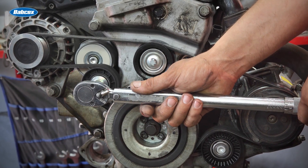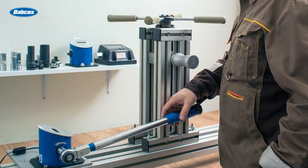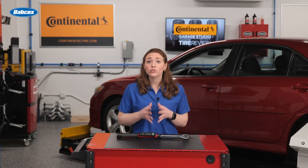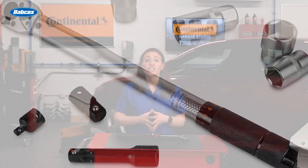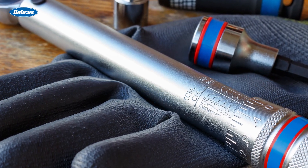So, how do you determine if your torque wrench is accurate? Some tool trucks have a torque wrench tester that can help spot a torque wrench that is malfunctioning. To do this, several torque settings are tested, including the highest and lowest settings. Note that it is not uncommon to find a torque wrench that's accurate at 50 foot-pounds, but significantly inaccurate at 25 or 150 foot-pounds. If the accuracy is off, you should send it out to be calibrated.